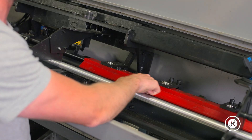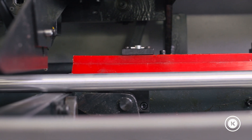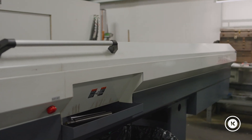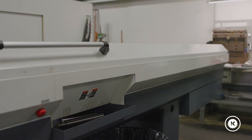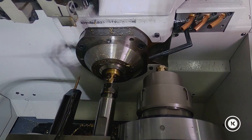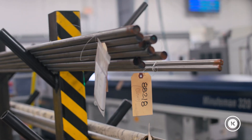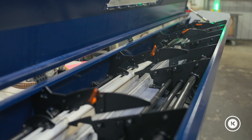If you look in here at these red channels, these are stabilizers for your material. This is a 12-foot bar loader. The longer the bar, the more droop you're going to get as it's coming out of the machine. The more droop, the more whip as it rotates, and the more whip, the more you're going to send vibrations back to your cutting tools — resulting in possibly having bad parts, bad finishes, and losing all of your cost savings that we got from getting the bar loader in the first place.